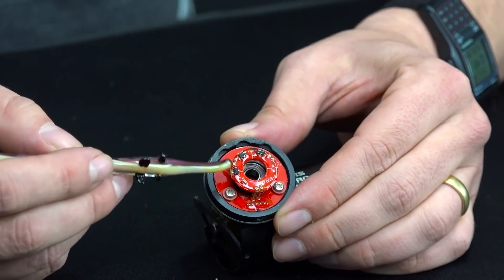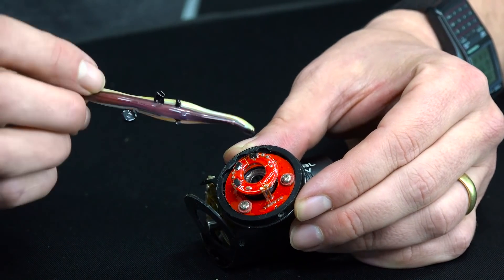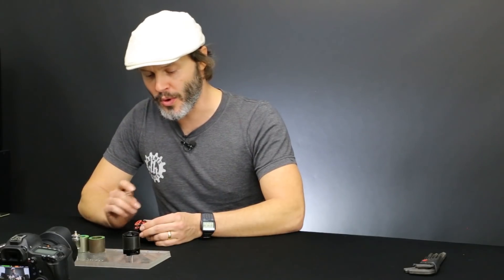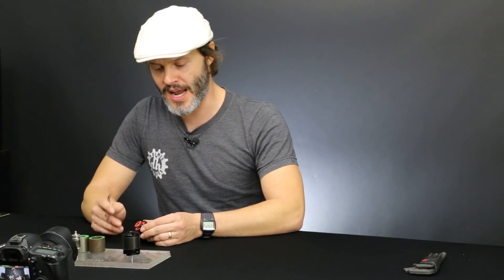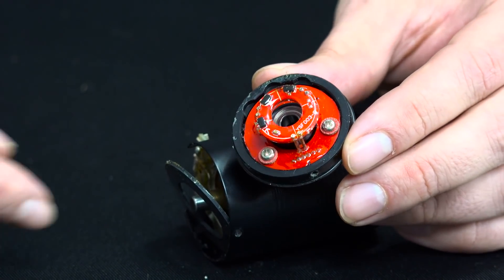We have the end cap and the sensor board on this particular model. Not all motors are sensored, but a lot of them are because it gives you better low speed control. Here's our sensor board — you can see three little black sensors on there and a couple of smaller components. Those are smoothing capacitors to provide a clean five or seven volt supply. The resistors on the board are pull-up resistors so the output doesn't jump around randomly. Pulled up to five volts, whenever the south pole comes around, it drops to zero volts, giving you rotor position — essentially Hall Effect feedback sensors.